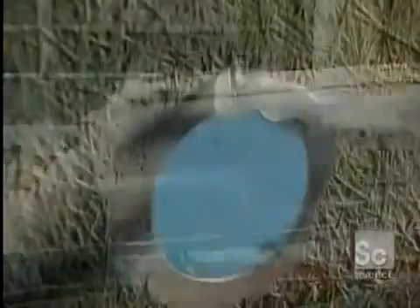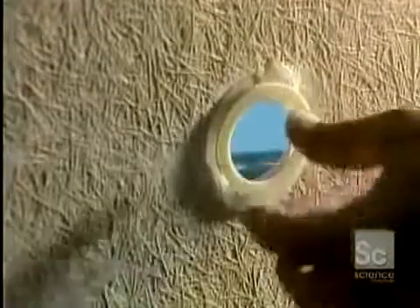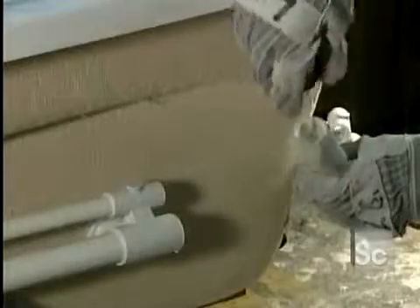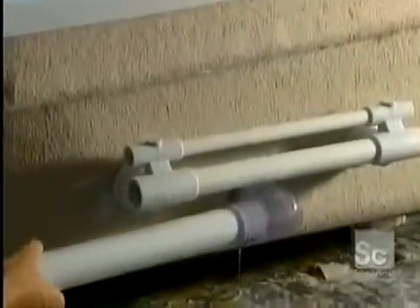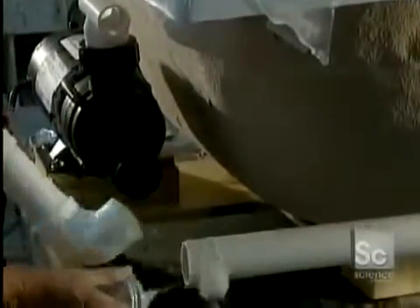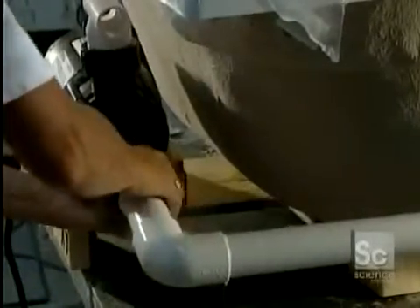The bathtub, almost completed, is now sent to another workshop. They can now install the pump, the piping, and the blower. These last operations are done manually. The pump is installed for the whirlpool system as well as the PVC pipes, whose joints have been hermetically sealed to prevent any leaks. Finally, to make sure that everything is functioning well, each bathtub undergoes a water test. The tub is finally ready after 13 steps and anywhere from 3 to 5 hours of work, depending on the type of tub. It almost invites you to climb in.